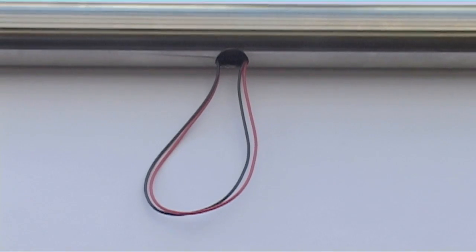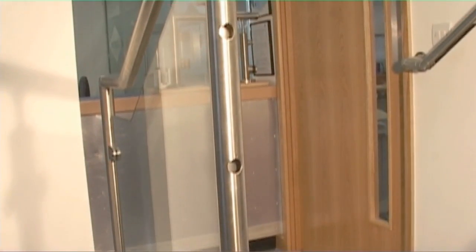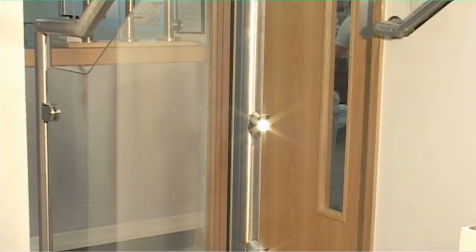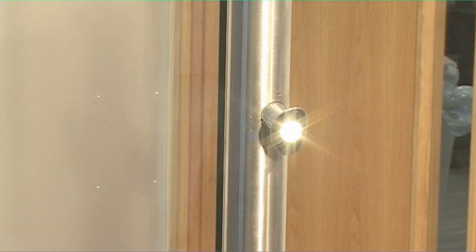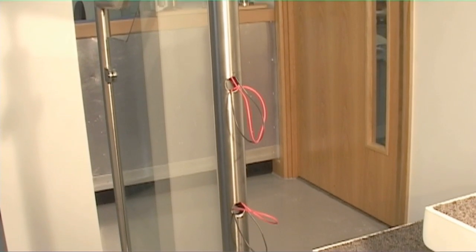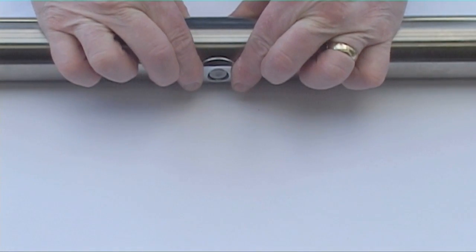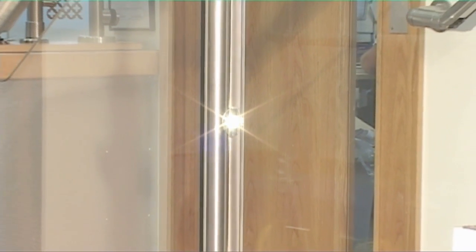When fitting the single lens LED pods, the cable is threaded through the handrail, which should have been pre-drilled with 24 millimetre diameter holes at 300 millimetre centres. The pods should not be inserted into the hole until all of the installation is tested. A small loop of connection cable should be pulled through the hole nearest to the transformer, and the first pod is fitted as described earlier. When all of the pods have been checked, they can be inserted into the tube where they simply click into place. Extra holes can be drilled into the flange to locate one or two 2 millimetre rivets for extra security.